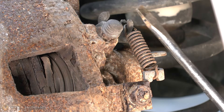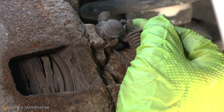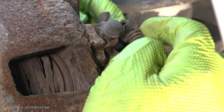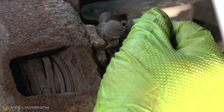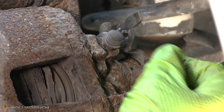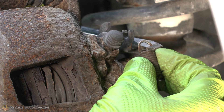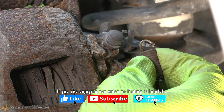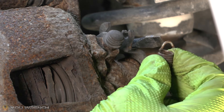Since mine's on the back, I don't want to be pointing the screwdriver towards myself. There's a little flat edge at the back that we can use as a leverage point. Put the screwdriver just under the edge of the spring and use that flat edge as the fulcrum — get just under the edge, twist up inside as much as possible, use the leverage, and it comes off. Simple as that.